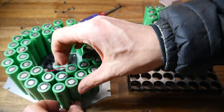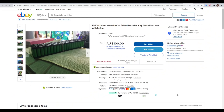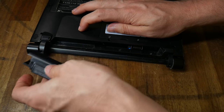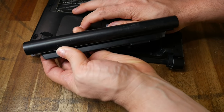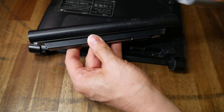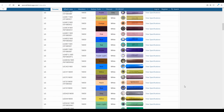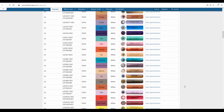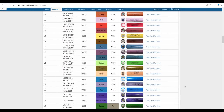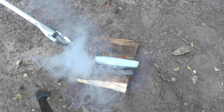So far we've talked about new cells, but the cells I used for this printer battery were actually second hand. I got 80 cells for $100 from eBay. The problem with second hand is you don't know exactly what you'll be getting, but they'll most likely be salvaged from laptop batteries, which means low discharge and high capacity but with possible wear and tear. There are websites like Second Life Storage where you can input the text and look up the colour to try and match your cells. Unless you're absolutely sure, assume the cells can only discharge around 10 amps - it's just not worth the risk if you overestimate.